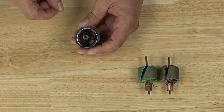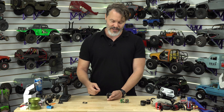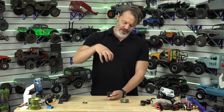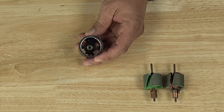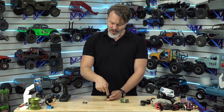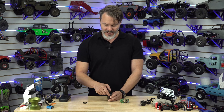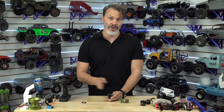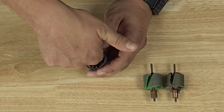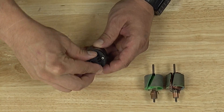What I was using originally was a set of spacers and jigs that I made. Part of it was I hired a machinist and they made some cones for me — the cones fit in and give a certain depth for the magnets — and then there were these t-bars. I would insert a t-bar in between, had to make sure it was well waxed so it didn't stick. I machined all the t-bars myself, so they weren't consumed with each motor. I made about 10 of them so we could do a tray of 10 at a time. I would put a shaft through the middle — just the shaft, nothing else.